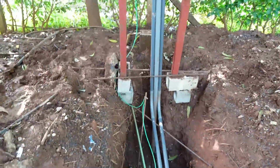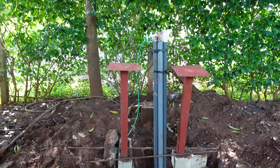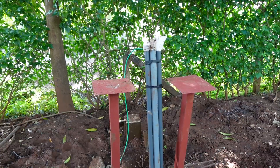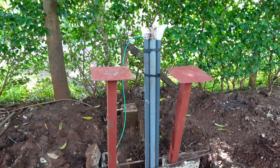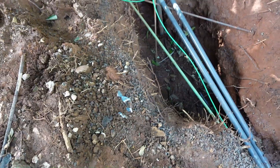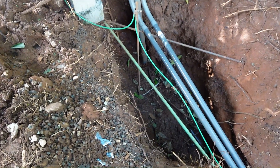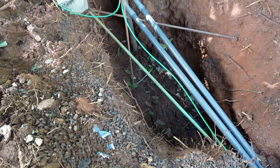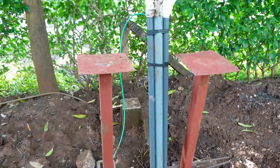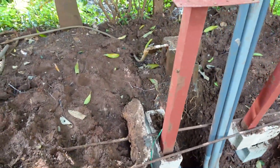Here's what we're going to do: the panel is going to sit on those two pedestals. We've got the two-inch in the center coming from the road up into a 200-amp panel. We're going to have a 60-amp feed to the casita and a 125-amp feed on number-two copper cables going back up to the house. This two-inch conduit took a deep dive way down into the bottom of the ditch - up here it's about three feet deep, down there it's five or six. That's going to be the challenge to cut the two-inch conduit and bring the wires up into the new panel. Right now I've got the pedestals just supported temporarily with cinder block and spiked down with rebar.